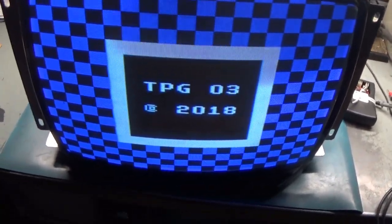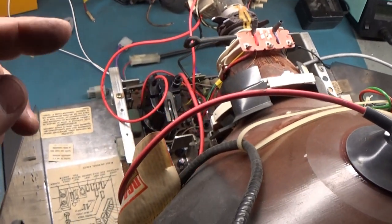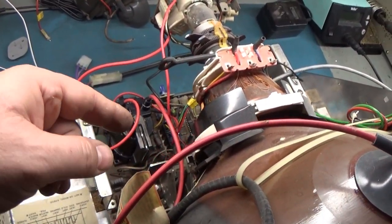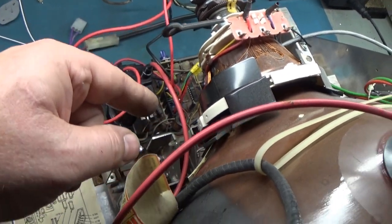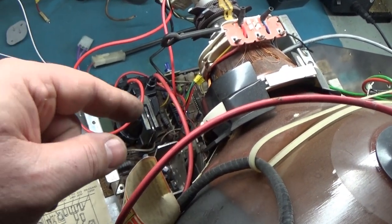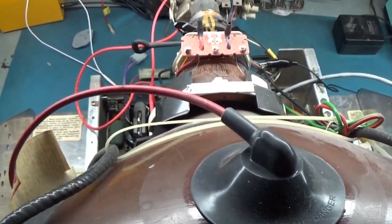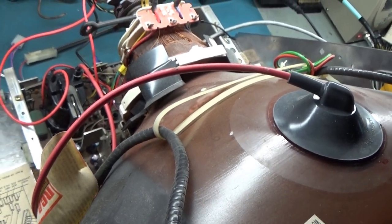But the chassis is now operational. I will let the owner decide what he wants to do about the flyback. There is no current replacement for the 4900 horizontal width coil. There is for the medium res 19-inch, but there is not a replacement for the standard res 19-inch. I may have another ferrite core here, but I don't know for sure.